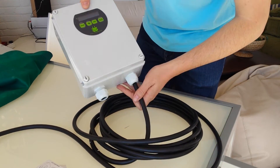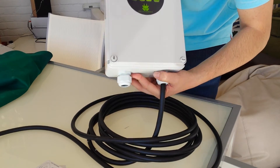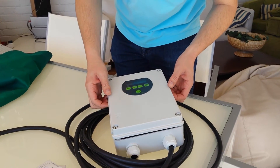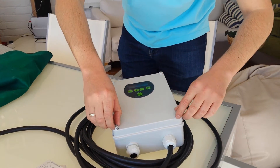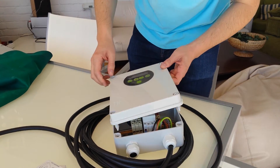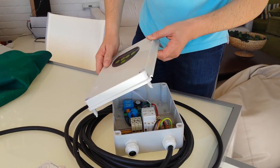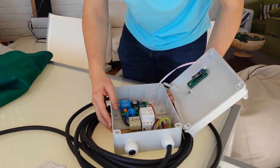Here it is — this is what I was waiting for. This is a brand new wall box. It's kind of a DIY case from a Spanish forum. But this is a very special box, because I can set it from 6 amps charging all the way up to 32 amps. That's basically 1200 watts all the way up to 7000 watts.